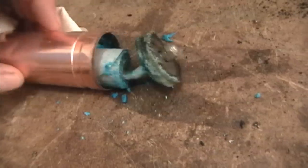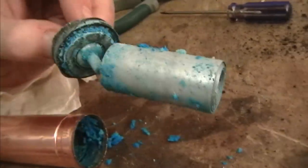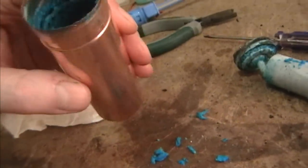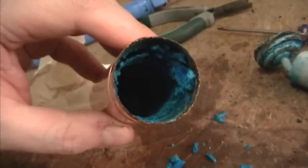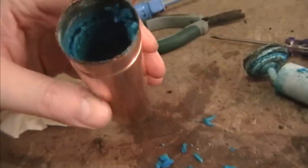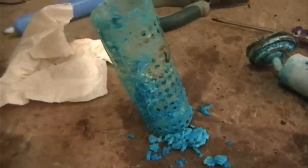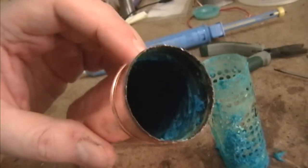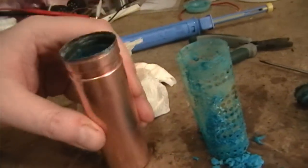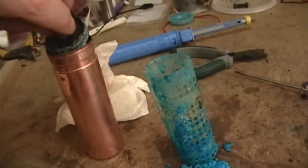All it took was one more tug and that disc came loose. Just like other caps I've pulled the guts out of, it's a spiral coil of aluminum, and originally this would have had a liquid in there which has long since dried up. But unlike other caps I've opened, this one is nice and pretty inside. They usually use a borax or boric acid solution, and when they're in aluminum cans they come out as white crystals — but here, because the copper was present, they made these nice blue crystals. Hopefully a warm water rinse will clean it right out so I can try putting some new caps inside — though this isn't the one I'm really going to use; I just wanted to experiment since it had dents and dings. I chose the better of the two to actually put in the radio, but since I'd never done one of these before I figured I'd use this one as a guinea pig.